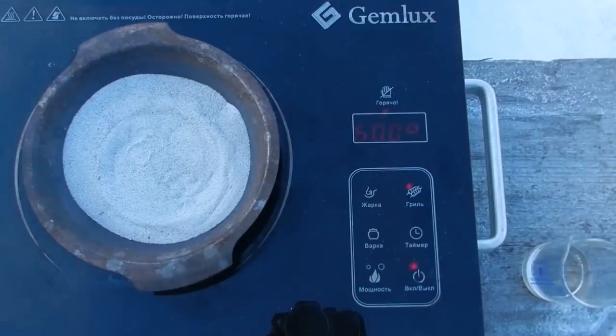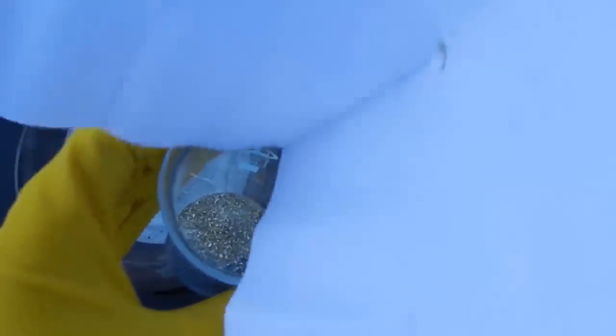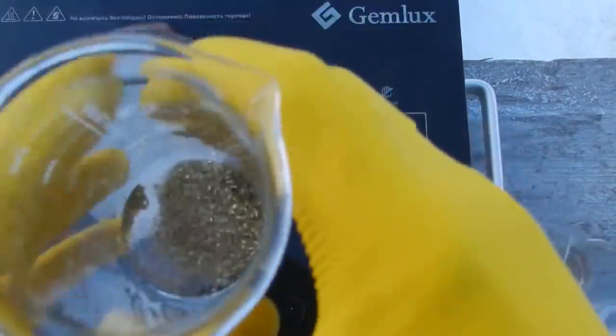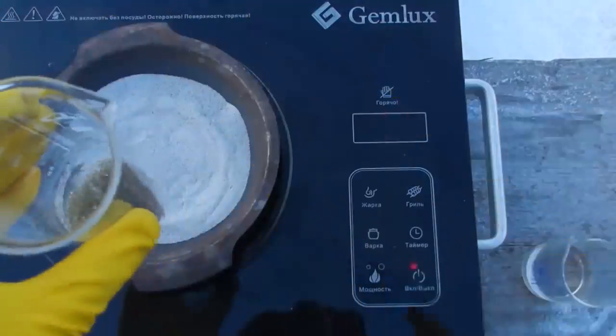When working with acids, it is unforgettable to wear goggles and wear gloves so that there are no burns on your hands. So now, I transfer a few grams of ingot shavings into a glass. Naturally, if even 1 milligram of gold does not show, then I don't see any reason to completely dissolve this ingot. But if it shows a qualitative reaction, then we dilute a little with water, so that the salts that form dissolve, and put it on a quartz bath.